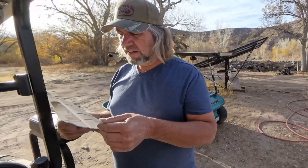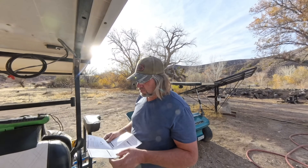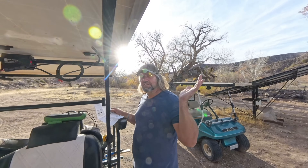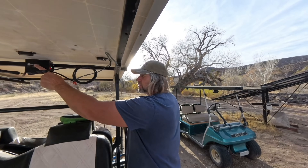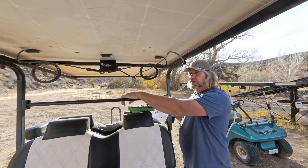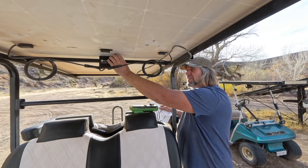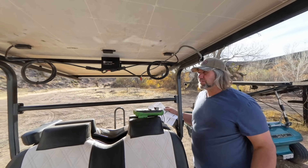This charge controller can do 60 volt, 70 volt, all the way from 20. You can go 24, 36, 48, 60, 72 volts battery bank with the same charger. For 48 volts and below, you keep it in the 48 volt switch point position. Switch it up to 60 and up to 72 to do more.